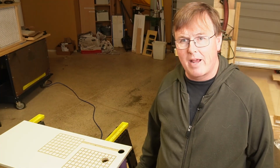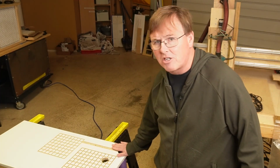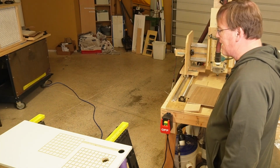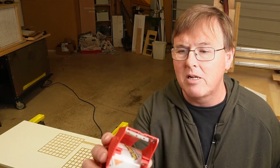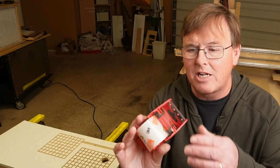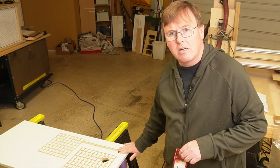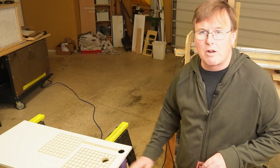Now let's look at an additional way besides dropping a board over that channel to seal it up. Is there another way that we could do this? And the answer is yes. I find it's an elegant way, and that is get yourself some 3M Scotch storage packing tape. And it just so happens that this is wide enough that it will go over the opening here of our Orbit sprinkler head, and it will also cover this in one fell swoop.